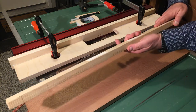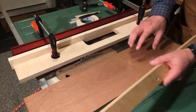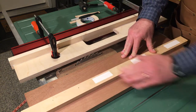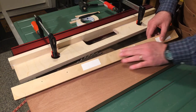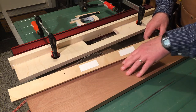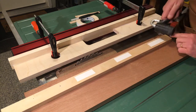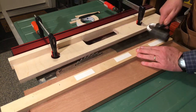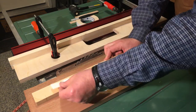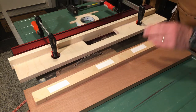We do that by using another little fence — a three-quarter-inch piece of plywood, nice and flat. This is just a rub fence. We're going to attach the rub fence to our work piece, which is a piece of sapele, and we're going to use double-sided tape. Double-sided tape is a very, very good jig material — it allows us to put this rub fence tight to the work piece without marring it. This stuff really sticks. I've already put three pieces down and rolled them out — I like to get a really nice tight contact with the rub fence. Now I'm going to put the fourth piece on and make sure we get good coverage, then rub it down and peel the backing off.